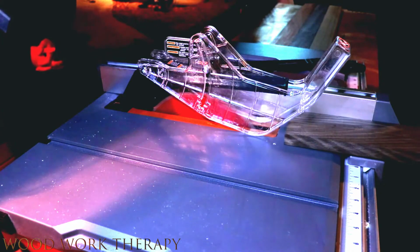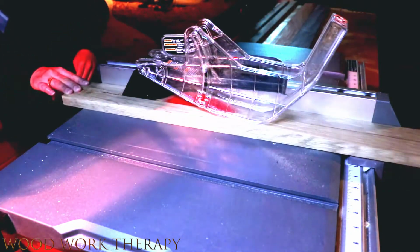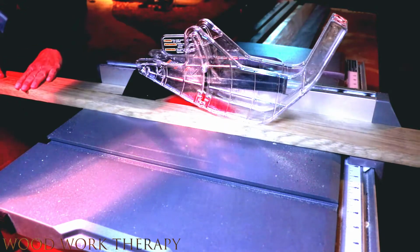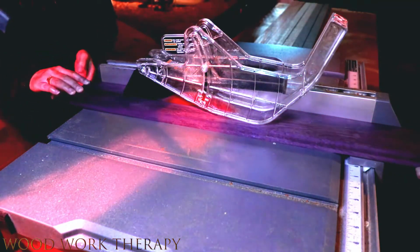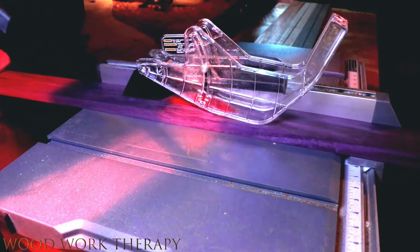Alright, the first thing you want to do is just go and cut your lumber down into strips. So you just kind of want to determine what size strips you want based off from how wide and how deep you want your cutting board to be. There's no real rules on this, but I would recommend going with something that's fairly meaty, just that way it gives that cool visual appeal, and it makes it nice and heavy so it won't slide around as much. And as you can see here, we use several different woods when doing this, and it does make a really shocking appearance when you do it that way, in a good way. So definitely something that looks very impressive.